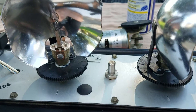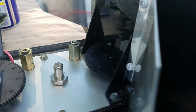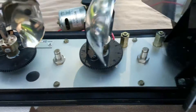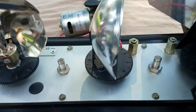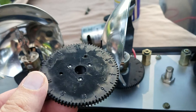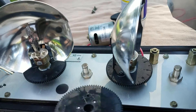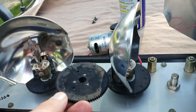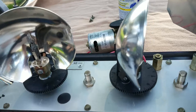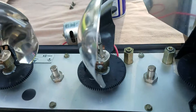That's about it — timing is fairly easy to do; it's just the center rotator piece that's a pain. If you've got a model 25, you don't have to worry about that since there's no speaker grill and you have access to everything. The same general principles apply: keep in mind the numbers on the gears — the idler numbers don't matter, it's the rotators that make the difference. Time your rotators how you want, drop your idler gear in the middle, and work your way down the bar. That's how you set your custom flash settings, and it gets interesting especially with the 10-rotator versions. Hopefully that was helpful — talk to you later.